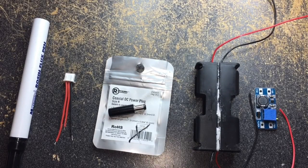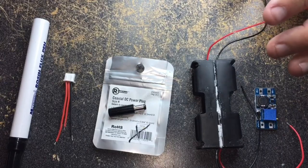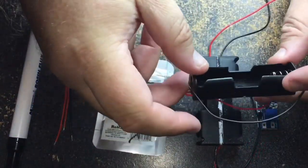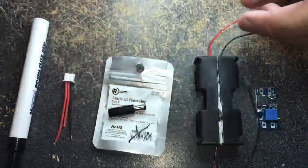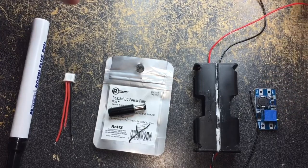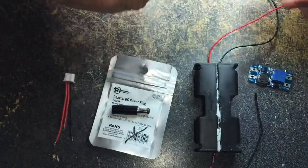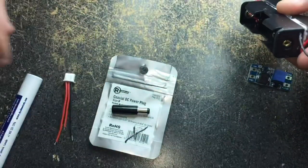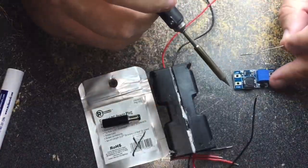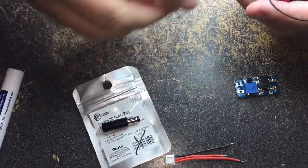This is Kilter Texan, and I'm going to show y'all what I do to make my FatShark batteries. My FatShark batteries are making my RapidFire module show low power condition. I got this kit from Amazon with 18650 battery holders - I glued a couple together - and one of these boost converters. When my FatShark batteries are fully charged the RapidFire wouldn't go into low power condition, so I'll use that boost converter to keep voltage on the higher end. We're going to take our 7.4V and set it to 9V, which is what the FatSharks take on a normal day.